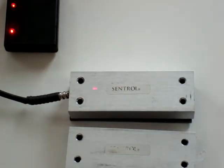This is a two part component. The top is commonly referred to as the contact, and in this case it has three reed switches installed that supposedly make this more difficult to defeat. The bottom is the target magnet which draws those reed switches opened and closed.